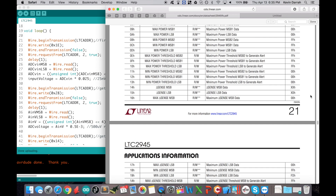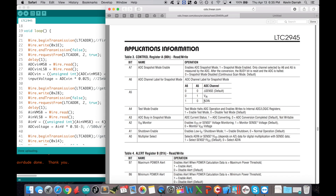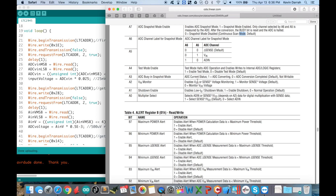Wire.begin(), then we read the input voltage first. Looking at the register map, out of the box we really don't have to configure anything. The control register lets you change the operation mode — for example, instead of continuous measurement you can put it into snapshot mode to trigger measurements on demand. But I'm allowing it to continuously run measurements, running at about 7.5Hz. By default it's in continuous scan mode, so nothing to change.